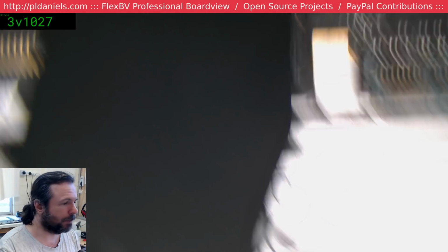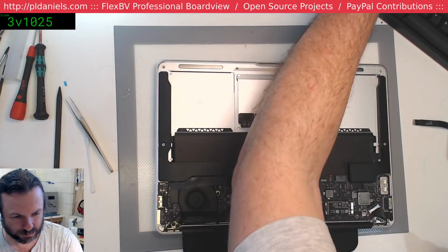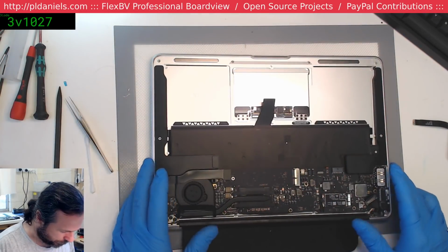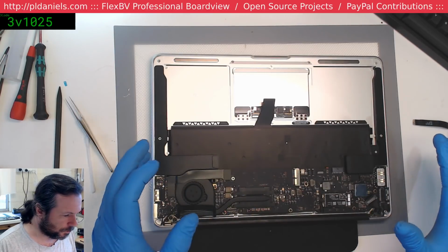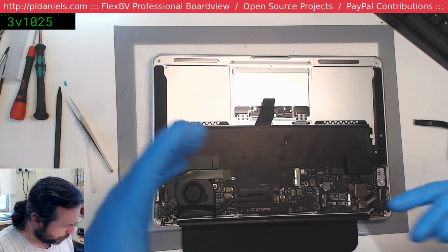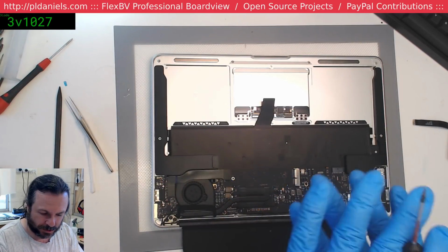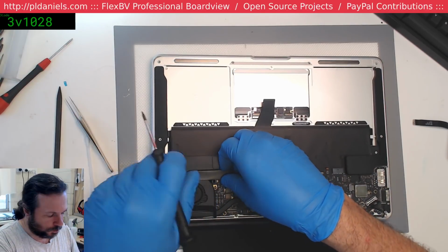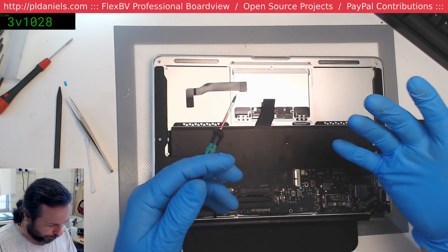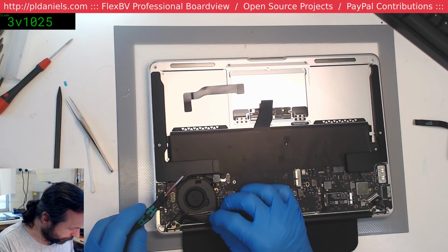But now this makes me want to take the board out and have a look. So what's likely happened is it was misbehaving. They've put it in shipping to send to me, and the shipping has caused the contacts to just shake back and forth a bit, which allowed them to make contact again, or break through the corrosion. And so when I powered it up, it worked.